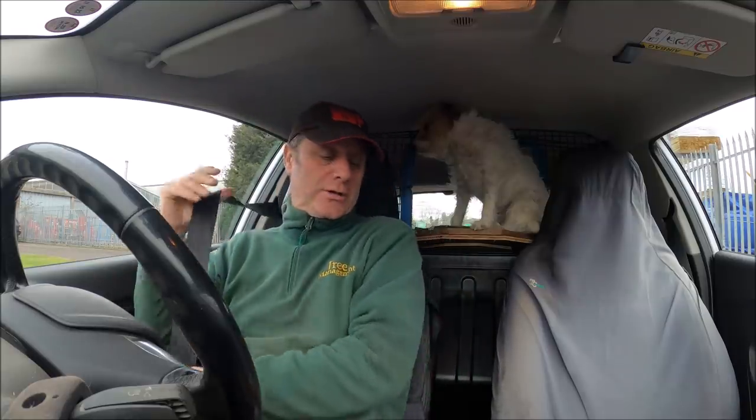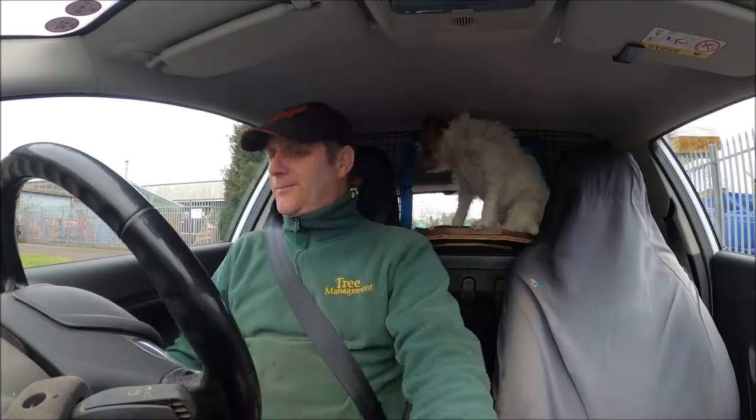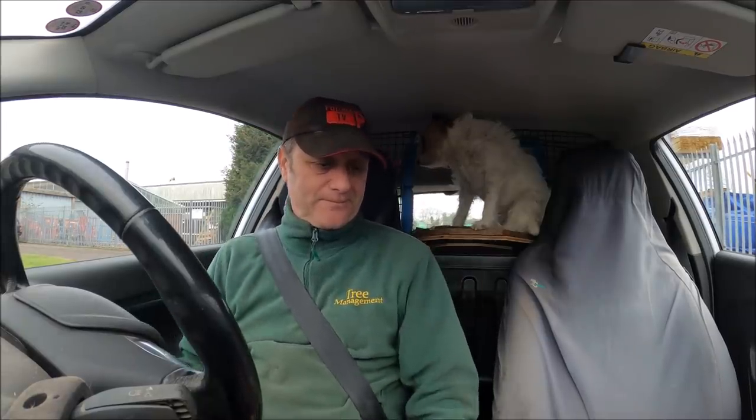Right, they don't have any. So if I want to get this thing fixed or put back together today, I've got to use one new belt and one old belt, which is not ideal. It'll work, but it does mean that I have to tighten up the belts enough to take the slack out of the old belt, but not so much that I put too much strain on the new one. It's a bit of a fine line. But being V-belts and they grip on the sides, I could probably get away with it.